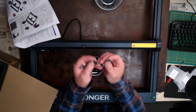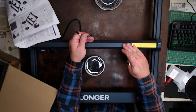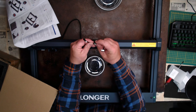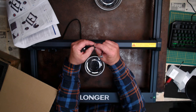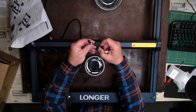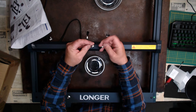They're both the same — just little micro switches. They tell the actual machine when the X-axis or the Y-axis has met its limits. It's basically on-off, like a doorbell — only on when you press it down. They're marked X and Y, so they are slightly different. That tells me they're not the same.